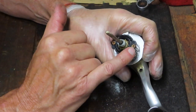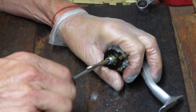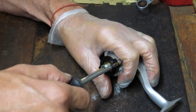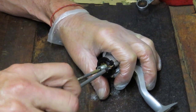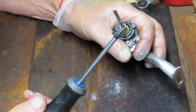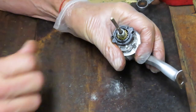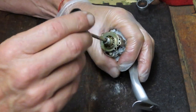We have a ball bearing held in by two tie downs on a clamp. So let's go ahead and pull the assembly while we're at it. I think we can do this without removing the main gear. And these are steel screws. So when I say this is kind of an entry level reel for them, that's one of the compromises you make. You have a steel screw as opposed to a stainless steel screw. One of the ways you can tell is that it's magnetic. Stainless steel is not magnetic. One of the problems you have with steel screws in a saltwater environment is that they are prone to rust. And then you might find yourself in trouble there.